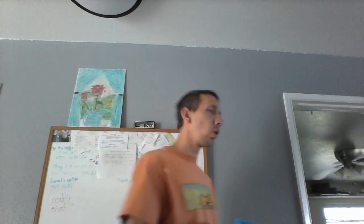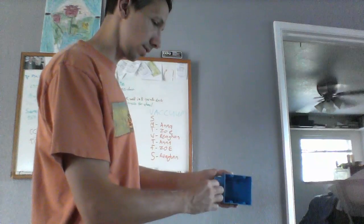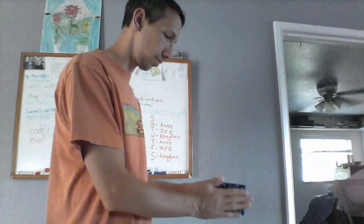Alright, we're back everyone, working on the wiring for the last part of our QuietCool 4700 whole house fan install. We've got our junction box here, we've got the high-low-off switch, and then we've got the timer switch right here. My plan is to put a box right about here, and I'm gonna try to locate that in here and just fit it in underneath the existing sheetrock.